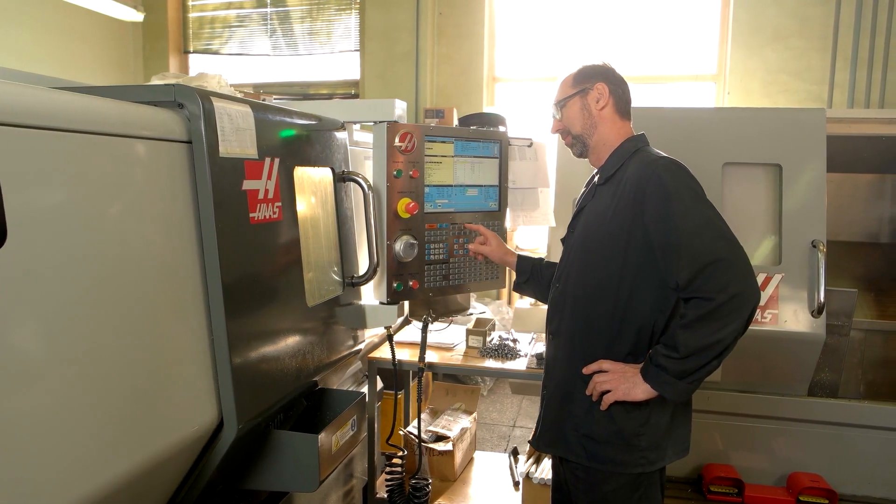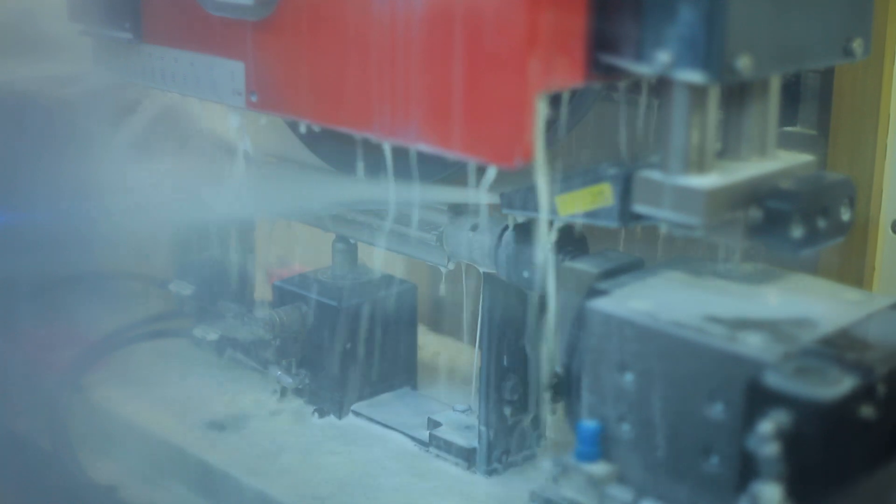If the product concentration is too low, the additives are too dilute to be effective. If it's over-concentration, you don't get any extra benefit — it's just extra cost. So using the fluid within the manufacturer's recommended limits gives you optimum product performance. That covers checking the concentration of metalworking fluid.